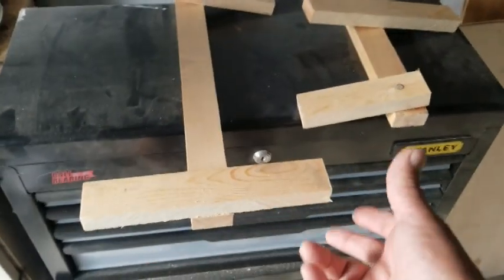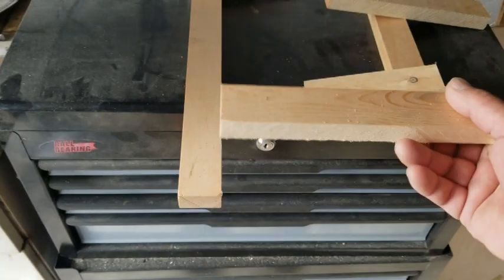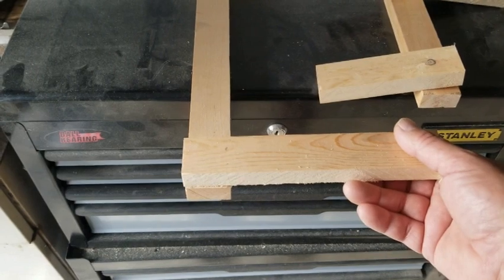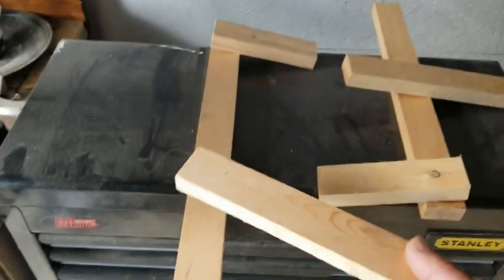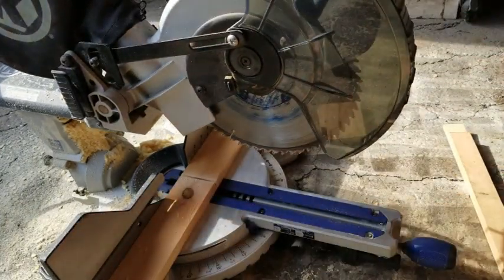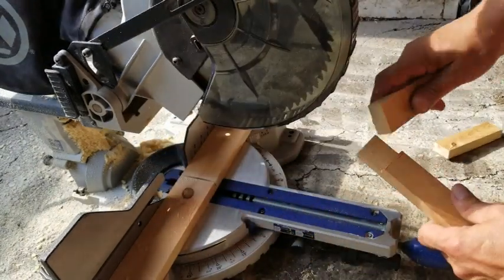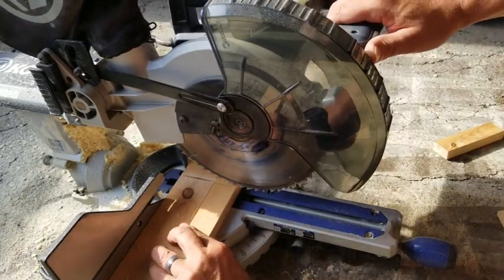I need to make some rabbet joints — I cut them all the same width. I'm going to grab it together. It's a rabbet joint where they're even: I'll cut half of this and half of this, put it together and glue it. I set the gauge and it only goes down so far — this is a stop — and I'm rabbiting out these little ends right here because they're going to overlap. Let me show you how to do it up close.